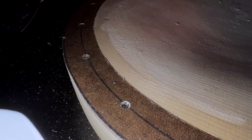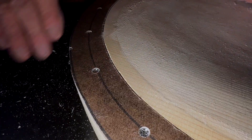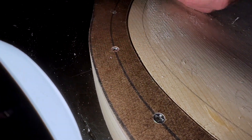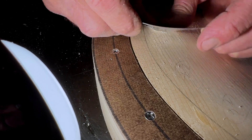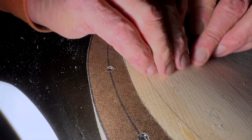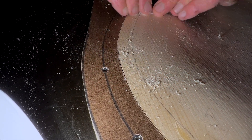And you can see over here we've got a little fuzzy stuff going on, which you can preen out by easing up on the pressure that you put on the scraper. And also you can get rid of it by laying the scraper forward a lot, and that means it's going to have a lot less rake. So when we do this, that's a lower rake condition, so the scraper isn't capable of digging in very much. You can see how it preens off those little fuzzy tear-outs that we got before when we were just going for a dimension.